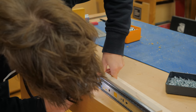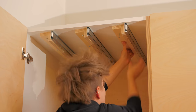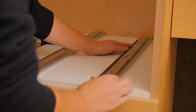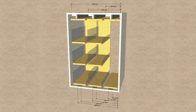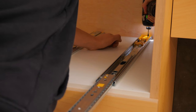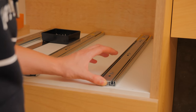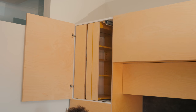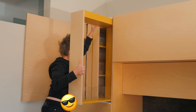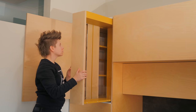I attached the slides to the L-shaped fixtures and installed the whole contraption to the top of the kitchen cabinet. To get the correct spacing measurements, I simply consulted the SketchUp file drawing I made previously and transposed the dimensions to the real cabinet. The slides that I'm using here were supposed to be click-to-open slides, but they didn't work very well. They were replaced by regular, inexpensive but super nice Amazon slides that can be purchased at a very cheap price. I'll leave the link below.